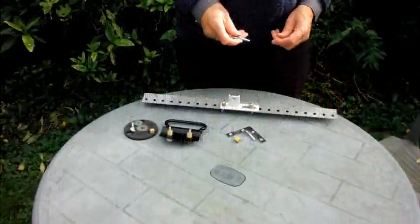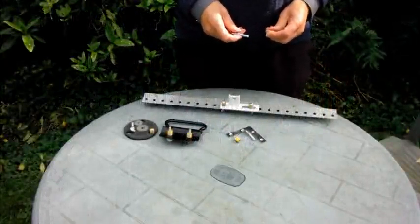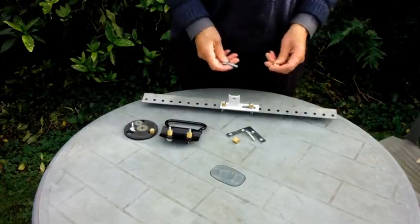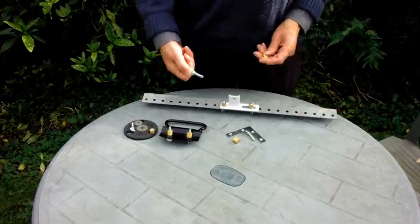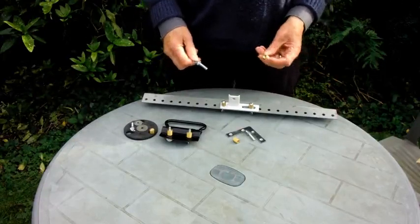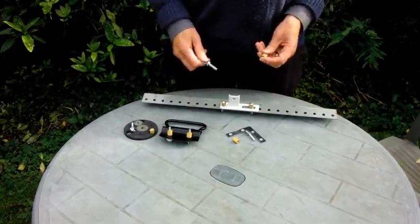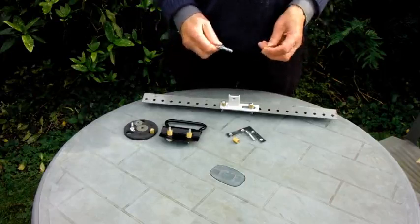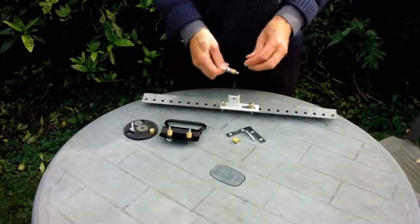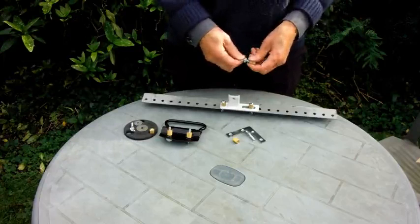This short video is about using Hunsworth hole clamps for temporary assembly and welding work. Each hole clamp consists of two parts, a zinc-plated screw and a knurled brass thumb nut. The screw is pushed through the holes of the items fitted together, and the knurled brass thumb nut is screwed on. No tools are needed for this.